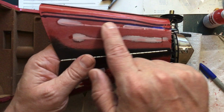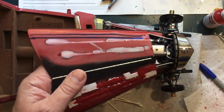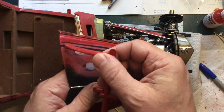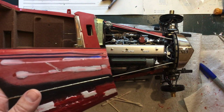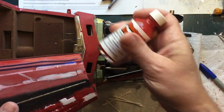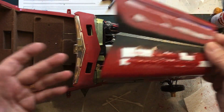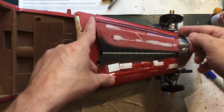And then where I cut it, fill that in, plastic weld it together with a soldering iron and some sprue material as filler. Plastic weld it all back together. Sand it smooth. Fill in any low points with my plastic melty goop here. Sand it back smooth. And that should be perfect. That should give me the perfect fit that I need.